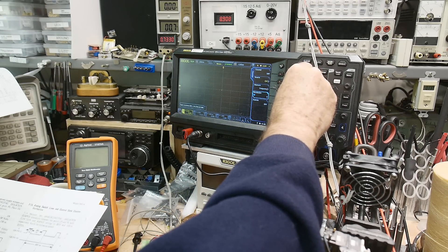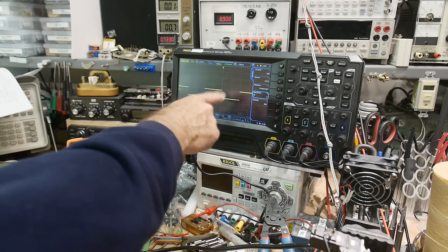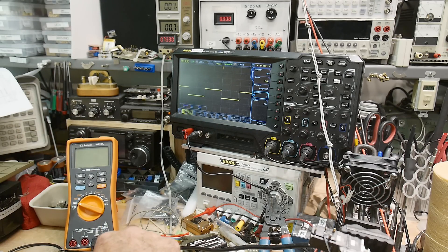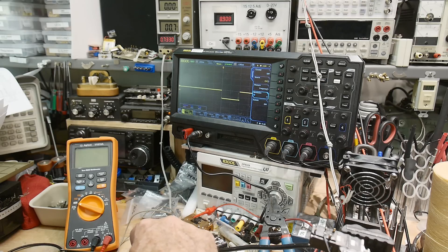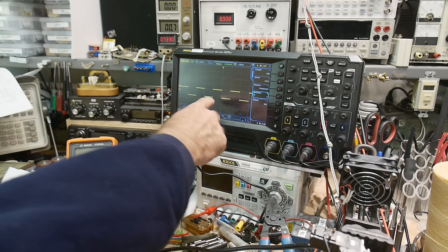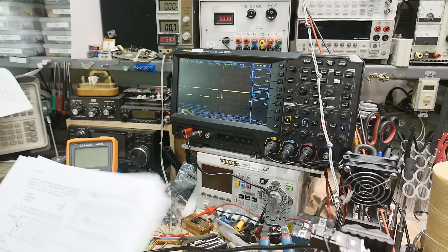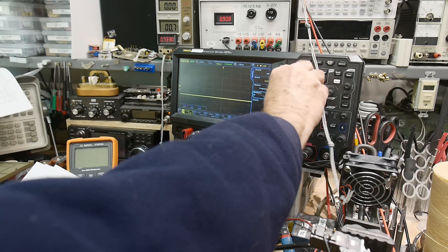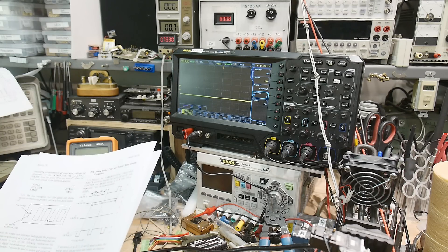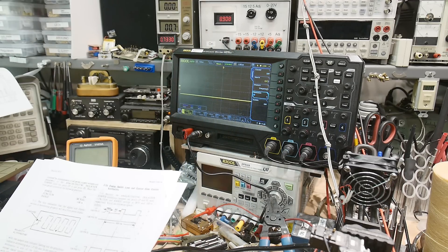We zoom way back out - 400 milliseconds, so I'm at 200 milliseconds per division, giving a 400 millisecond half-period. That's good. Then it says look at TC - we go to TC and it says you should have 200 milliseconds. Spot on. Then it says go to RS, and if we zoom way in, there are little pulses. Those should be about 100 microseconds - and yes, it's about 100 microseconds. That's working good.